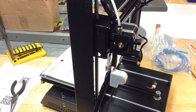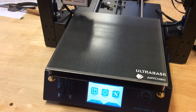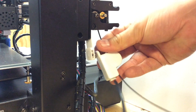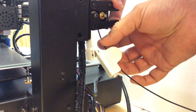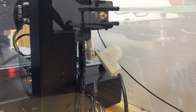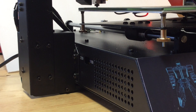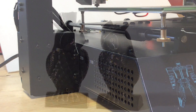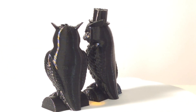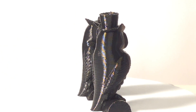The bed material is really interesting — it's got a glass bed with what they call an ultra base. It's kind of rough and spotty but it really works well and it's painted right on. I loaded up some filament through the filament sensor and pushed it into the extruder by hand. I got some filament flowing and then needed to level the bed, which was tough because the base was bent at the back — you can tell by the springs how much I had to adjust. That was damaged in shipping. But it printed very good. The first sample print from the SD card — two owls at about 0.2 layer height — came out really nice for a first print. I'm impressed already.